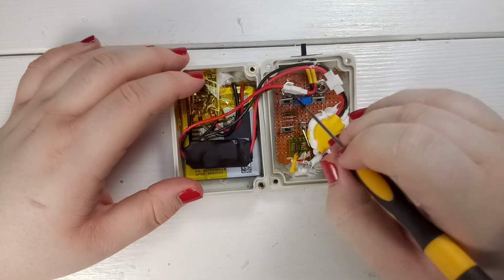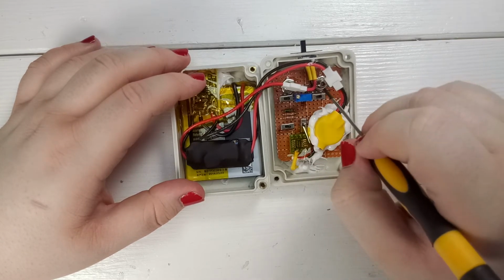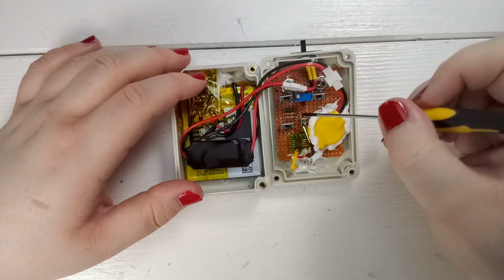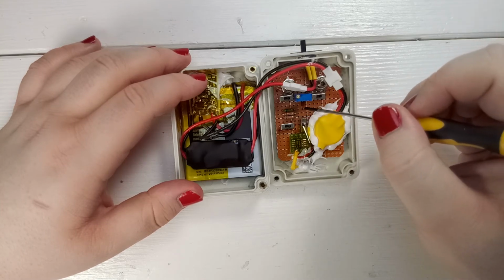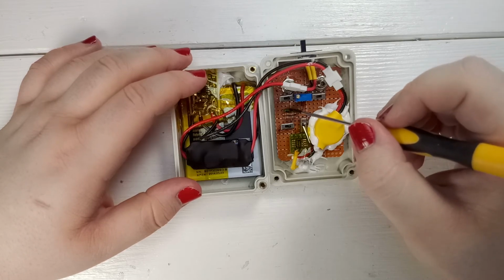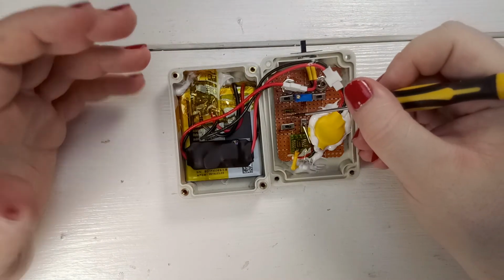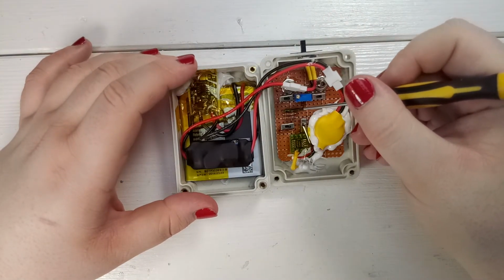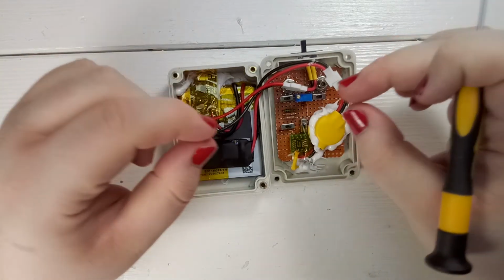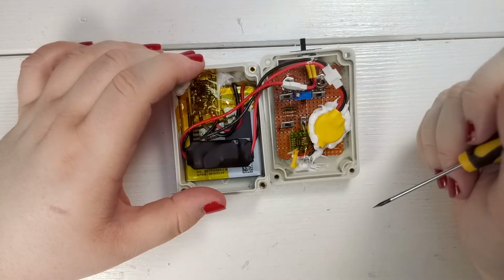So we have the two binding posts connected to these copper wires that I just wrapped around and tightened down with a nut. I used a bit of glue so it stays in place. I have the trimming circuitry that consists of a diode, the 50k multi-turn potentiometer, and the 27k resistor. I don't have a 27 kilo ohm resistor, so I used two 13 kilo ohm resistors and one 1 kilo ohm resistor. I have these four switches facing inwards towards the circuitry, which means that it's not engaged. All are disengaged.